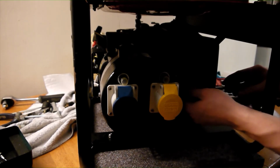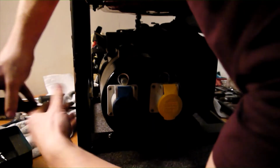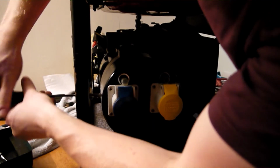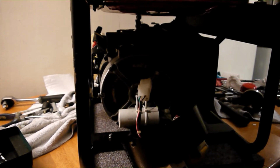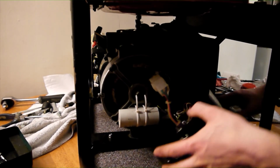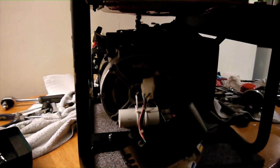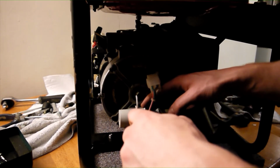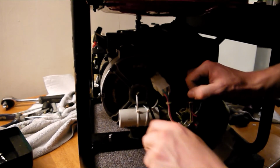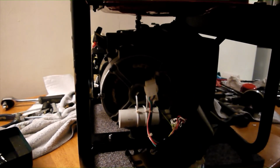The last item to be replaced is the output regulator capacitor. Loosen the two screws on either side of the generator head, as shown here, then rotate to remove the plate. Even though this capacitor is still functioning, capacitors larger than 1 inch in diameter can be prone to failing after 10 to 15 years, especially in this environment, as this capacitor is exposed to extremes of temperature as the generator is stored and used. Replacing this capacitor before it fails is essential.